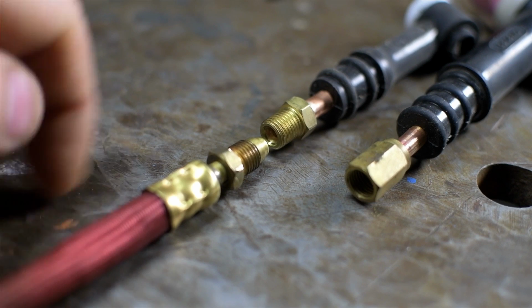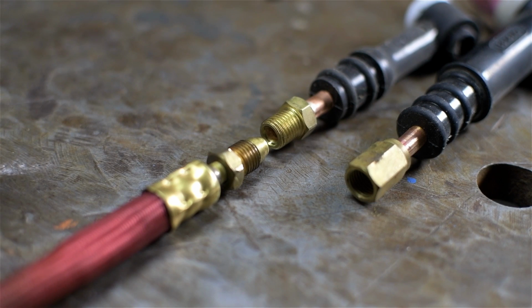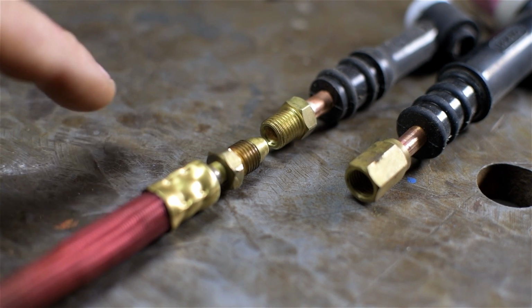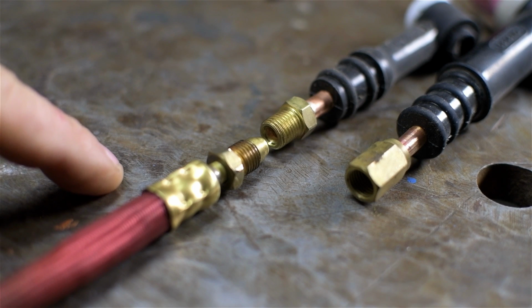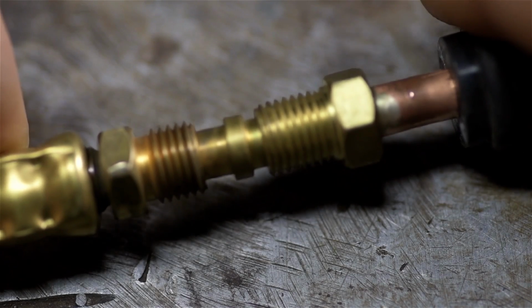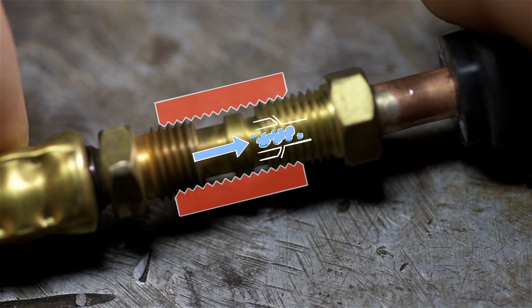And what I'd like to do is just make a quick connection to get this torch on this hose. Essentially just like a threaded coupling. Now, yes, I will be wasting some brass, and yes, I could probably just drive out and buy this, but I want it now. Luckily in this case, the connections are set up such that the conical seats can still seal off on themselves, so I'm not really worried about gas leaking. I really just need to mechanically connect the two.